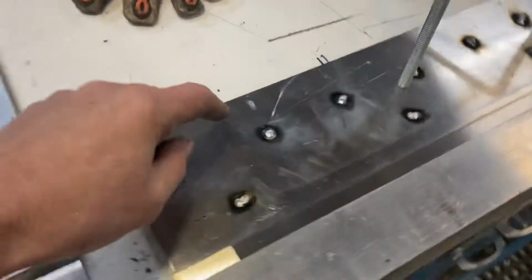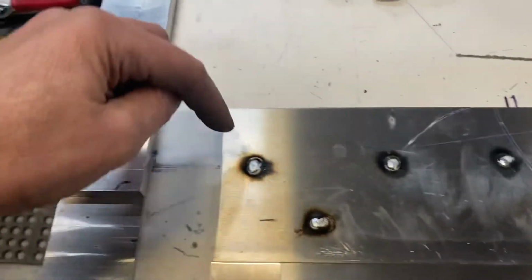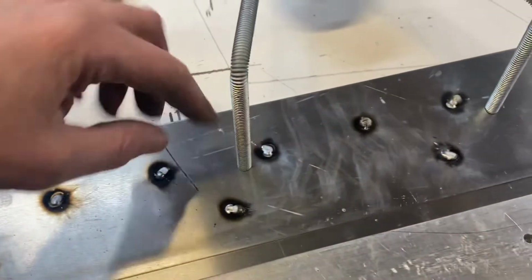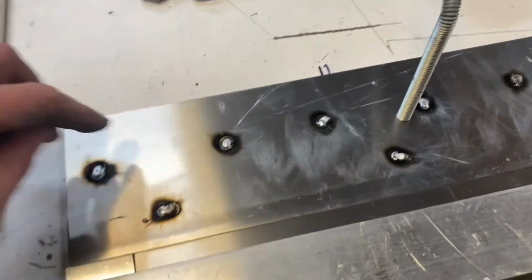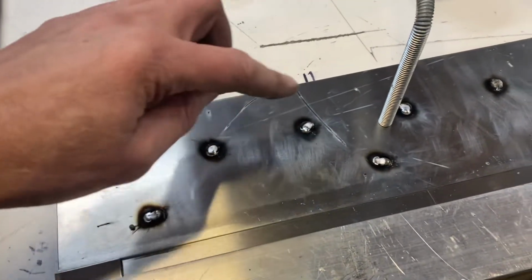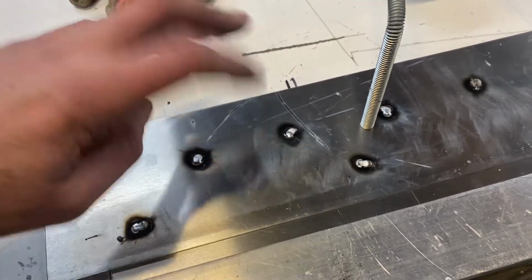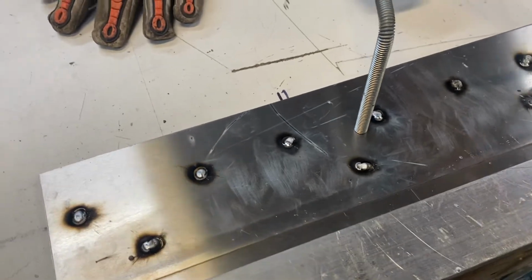This is going to be the center layer. I forget what these kind of welds are called, but I drill a bunch of holes and then fill them with aluminum to get them attached together. Then I'll run a flapper disc over this to knock it down flat again, and then sandwich that third piece on the same way by drilling holes and welding through it. So what else is going on?